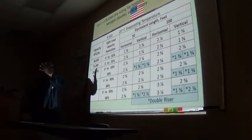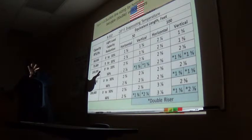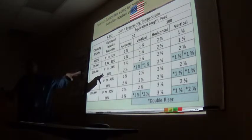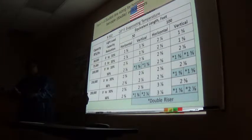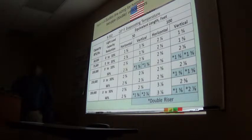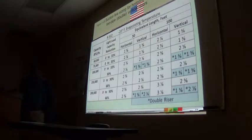You see, when you size the boxes, it's with the premise that these people are gonna keep it at least 50% loaded. Other than that, it's not gonna perform the way it was designed to. No way, shape, or form. So don't feel bad, it's not your fault. You explain that to them, right? You say, this is on the premise that you're gonna keep this thing half full. At least. And at least you're an optimist, you said half full and not half empty.